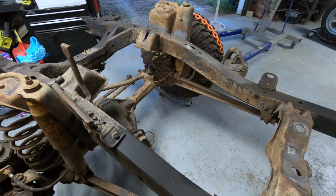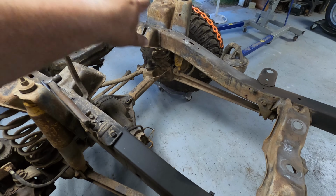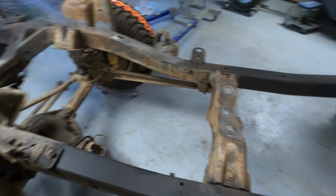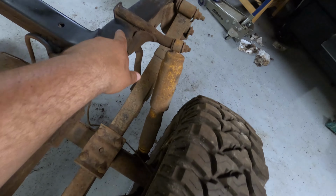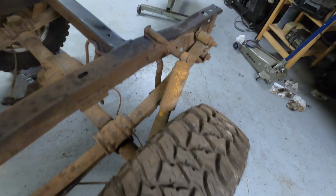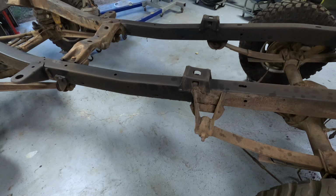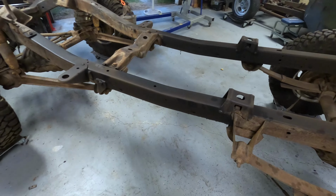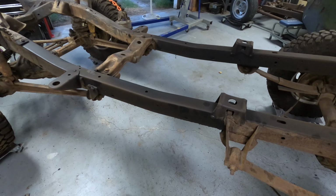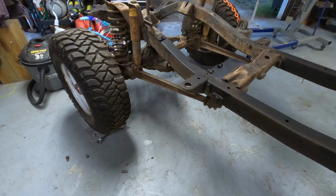Thinking about getting my little blaster pot and some sand and doing most of this up here and this through here, especially right in here. And just kind of going through it, since I don't think I'll have it sent off, and continue what we're doing with the rails. Any flat spots, we'll just do them with a wire wheel and everything.